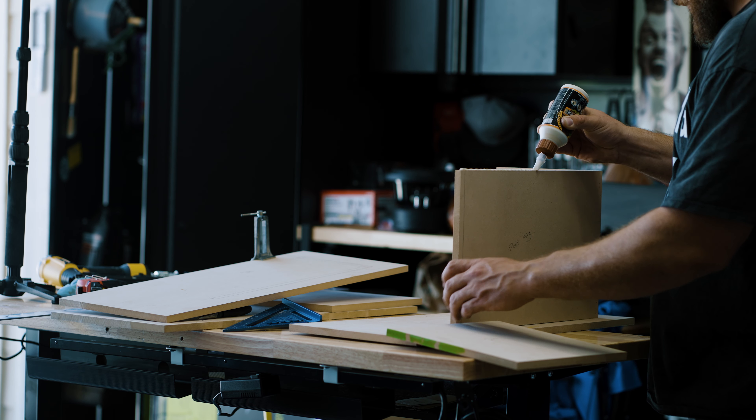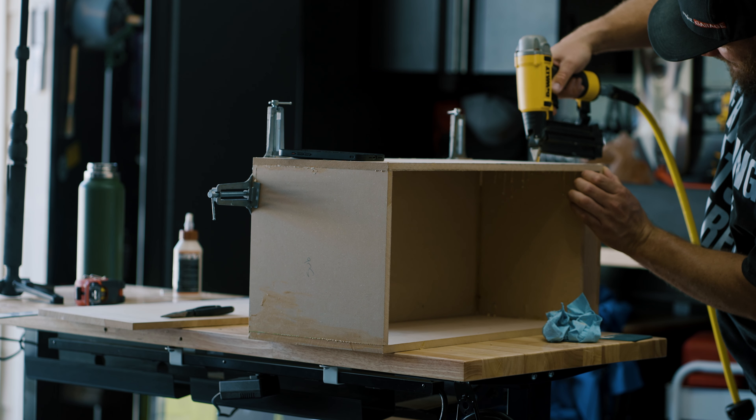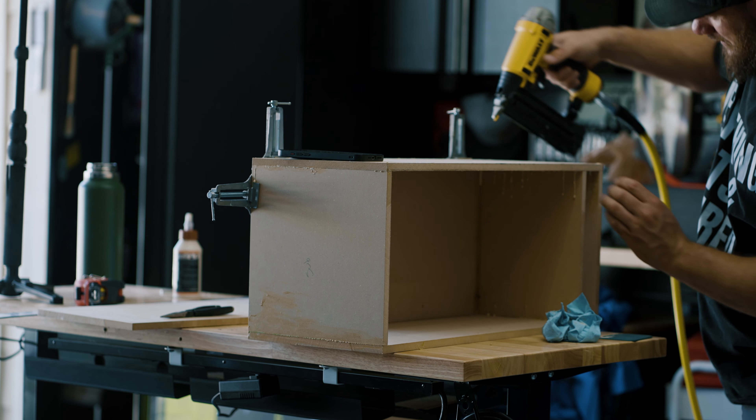For assembly, you're gonna need some wood glue, and then you can either use drywall screws or whatever type of screws you feel like using. If you're gonna use screws, I will heavily recommend doing a pilot hole and then using the inset drill bit that will give room for the head — unless you have self-tapping screws, and I would be careful with those because they'll go straight through MDF, especially half-inch, and then you'll end up with a box you can't use. Personally, I don't really love screws; I've had too many instances where it'll bulge the wood itself. Alternatively, you can use nails. I have a pneumatic nail gun with a pancake compressor — this has been huge for me because you can load a bunch of nails in there and just bang bang bang pretty quickly, and it's the fastest possible process and it's very strong.